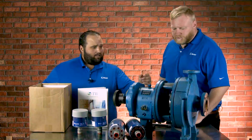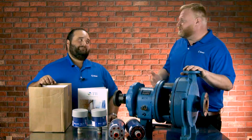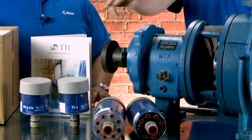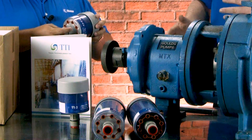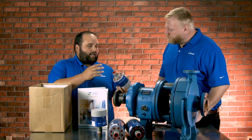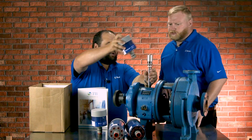In this application, we've got a mock-up here of a pump. Obviously, we're doing away with this standard plug. With this pump — a little Gould's pump setup seen in a lot of different industries — for this smaller reservoir, I'm probably going to lean more towards the TT2 or TT2-CV. It depends on the application and industry. A lot of steam and wash-down environments may lean more towards the TT2-CV. In a lot of cases we're going to thread this directly onto the housing, but we may also opt for the use of an adapter.